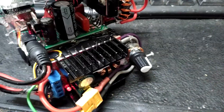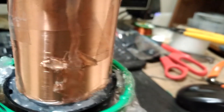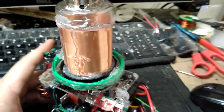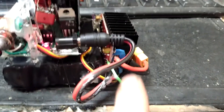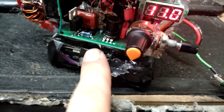Same 35-volt boost module, but it's capped at about 26 volts physically. 12-volt 18650 cells, three in series. Had to splice this a couple times. There's a capacitor and ground here on the negative of the boost module, because without that sometimes it will kick out the boost module — or actually it might be the protection board on these cells.